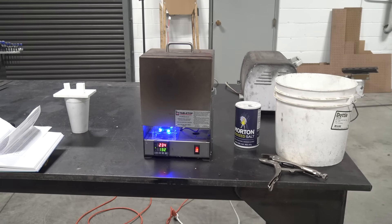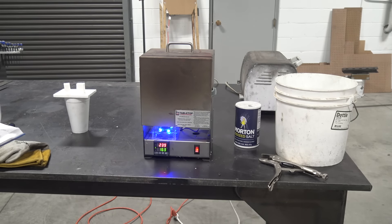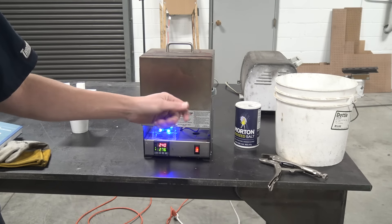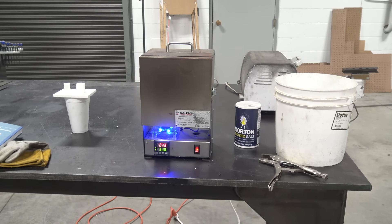While that thing is warming up doing its soak and heat treat, we'll mix in the salt. The book says water should contain 10% salt as a brine solution. Salt coats the parts while they're being quenched to aid in the reduction of scale and give more hardness — the water near the part is actually boiling. I don't have a stainless steel foil bag, which would be a way to keep oxygen out of the heat treat oven. The other way is a vacuum heat treat, which is probably how a lot of big shops do it. So these parts may get some scale on them, and may also change tolerances — I just realized I didn't measure this one. We'll do that on the O1 part.